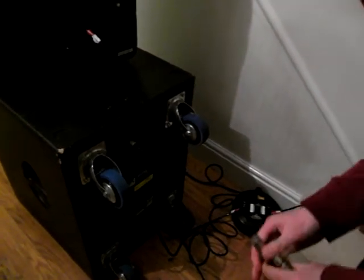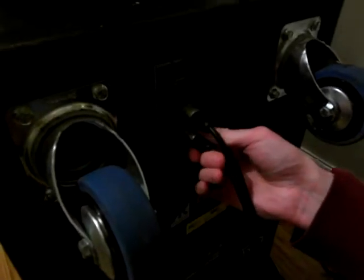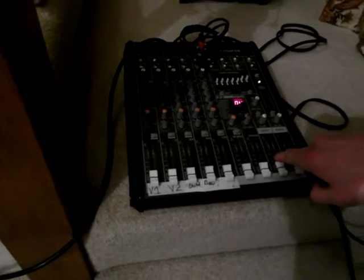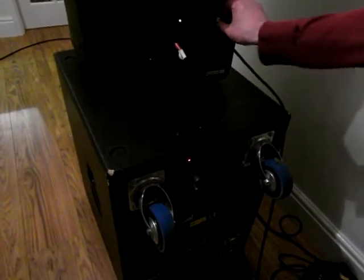Some subs and speakers have a high-pass output which only lets through anything above about 125 Hertz. This H&K has a full-range output, so we go straight into the input of the mid-top, with the red gain pot on the sub to adjust level. Always turn your amps or powered units on first, then turn your speaker drivers on. Set the gains up to 0 dB — that's what's recommended in the instructions.